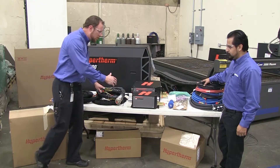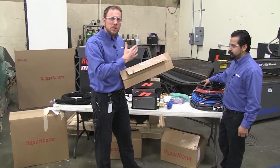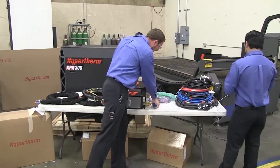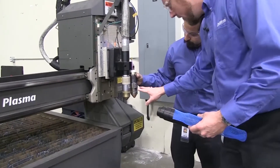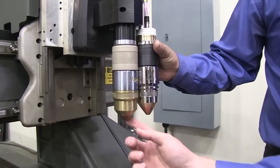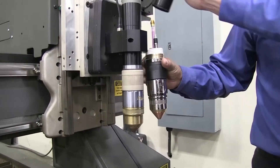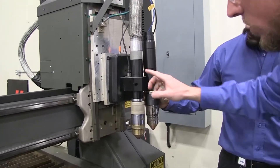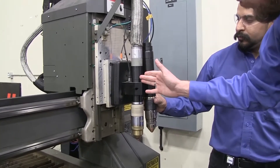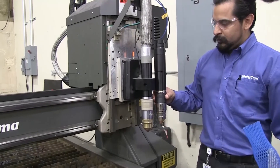Here's what I noticed about how simple the connections are. We went ahead and put one of our older plasma systems right over here so we could compare. Let's take this torch out and look over here. We're out of the package now — awesome look on the logo. You can see the difference between the two bevels: this is much steeper than the old HPR 260/400 bevel. Also notice there's a little bit more belling out here. This is slightly larger than the old one, which makes room for the coolant and gas flow. This also has vented water as well as optimal mixed gas for stainless cutting.